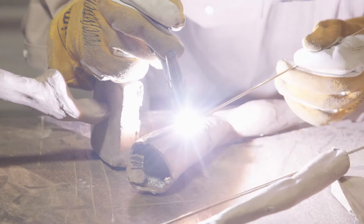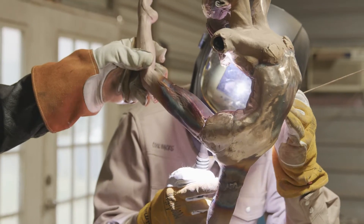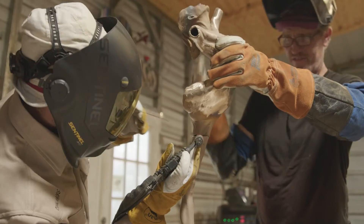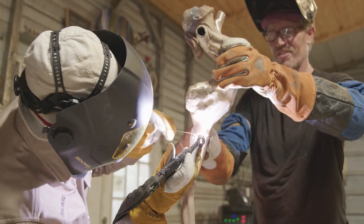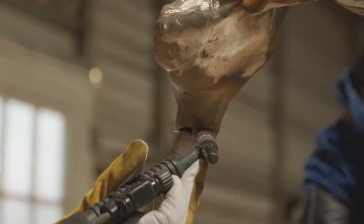What kind of welding is it? We use TIG. It's interesting — most welders I get have pipe welding experience and they lay down big, pretty, colorful welds, but bronze is very soft and I have to do cleanup on the weld. I want them nice and flat, with as little sanding and grinding as possible. One of the things I want people to know is there's more out there than pipe welding or plate welding — there's opportunity to branch out into something different. Even as a creative outlet, welders could parlay that into a job. One of the largest foundries in the United States is in Austin, Texas, and they hire welders all day long.